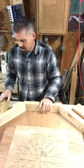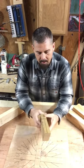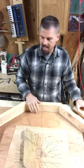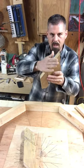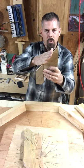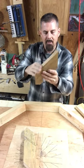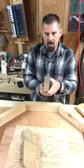Now the hip — this part is a little complicated, only in that it's slightly difficult to explain. There's something called an inclined plane, which is basically the plane of the tops of the spines of the rafters. With a common rafter, it's pretty straightforward — it's like the plywood that runs across the back of the common rafter. Your rafter can't be twisted underneath the plywood or you won't get full purchase of the plywood. That's one of the characteristics of a common rafter: it gets full purchase on the plywood along the spine of it.